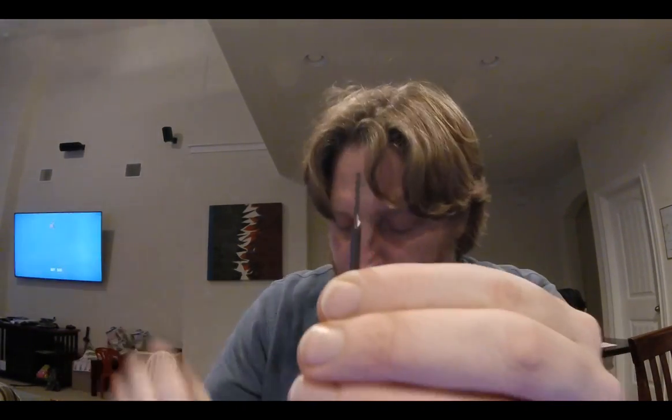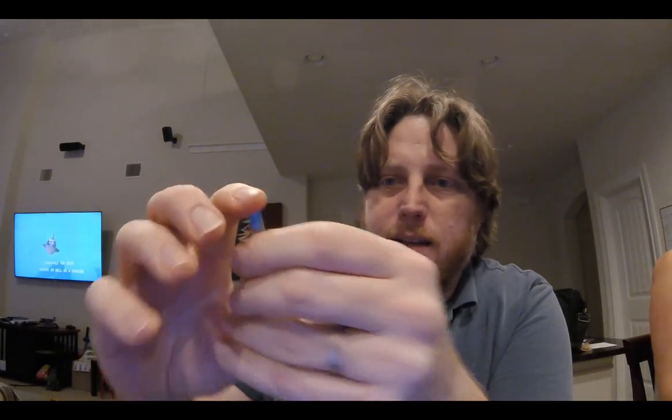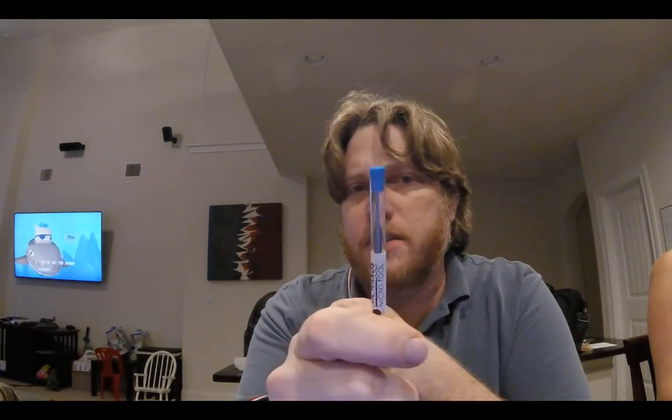Hilarious. I totally forgot. Check these out. I'm not going to use them on this project, so I'm probably not even going to try to test them. This is a 16th inch end mill. Kind of like the other 16th inch. Itty bitty 16th inch end mill. It's got a half inch cut depth, which is a lot for a 16th inch end mill. Most of them only have a quarter, so why would I have this? I think it's for when I'm doing any carving and I really have to get down inside something. So we'll see. Not going to use this tonight. Not going to mess with this tonight, but I just thought it was cool, so I was going to show it anyways.